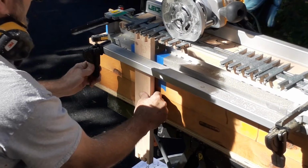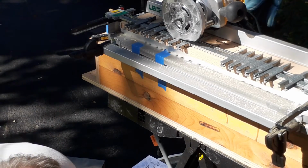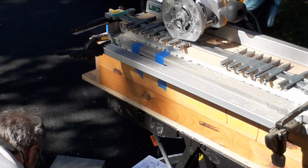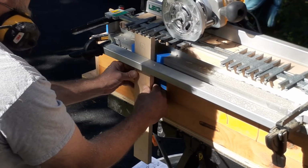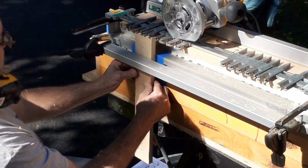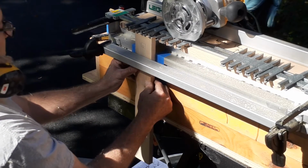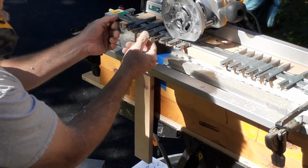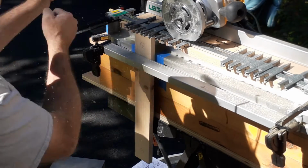Another tip I have for you is, not a tip, but the process is to cut both tail boards out. Obviously, it may be obvious, but we'll just mention it. And you don't want to put a lot of pressure on when you're routing against these pins. They're locked down with the screws, but they recommend you don't put a lot of side pressure this way or like this.